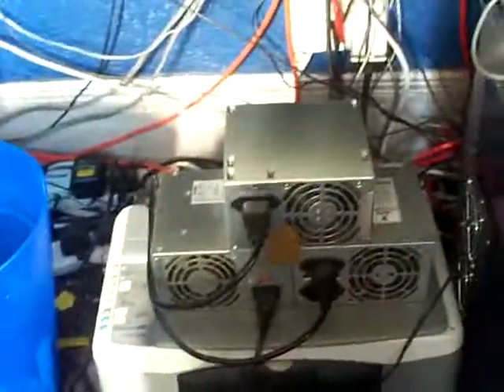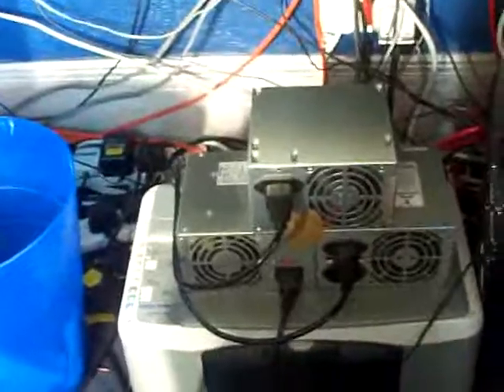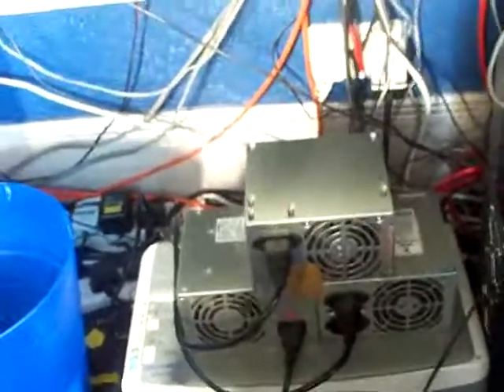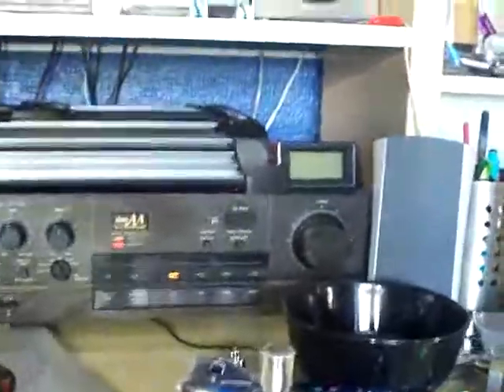So that is why I need to somehow either boost the voltage a bit, so I'm getting 13.5 on the idle — which is what my PSU would do if I built it with my bridge rectifiers and shit — or just buy loads more computer PSUs, because that's the problem with computer PSUs: they only put out about 12 volts or under, they don't put out 13.5 which is what that needs really. So if you've got any ideas, hit me up, leave a comment, cheers for watching.